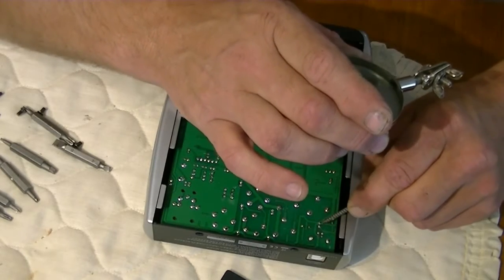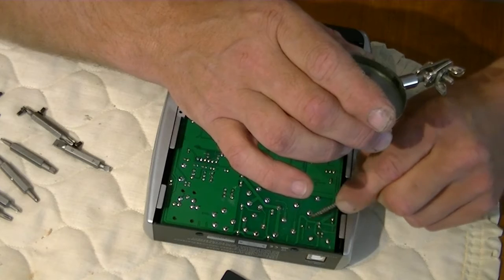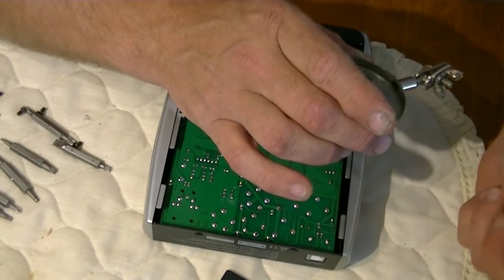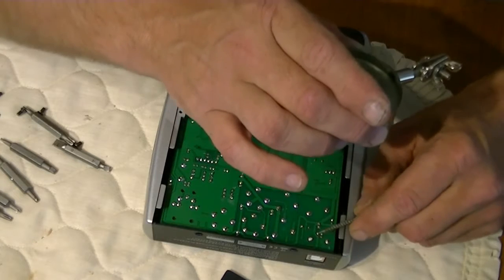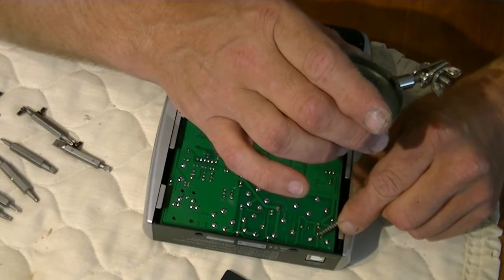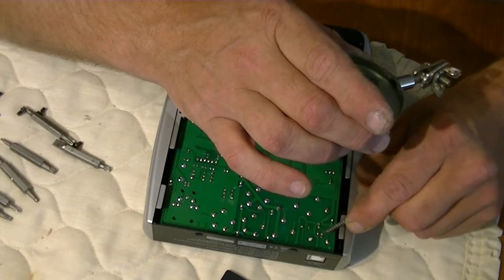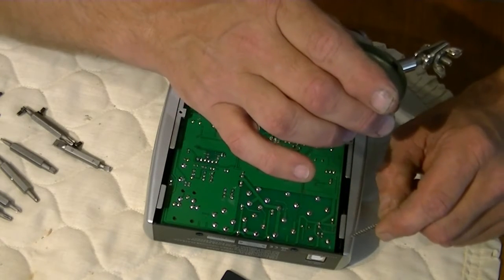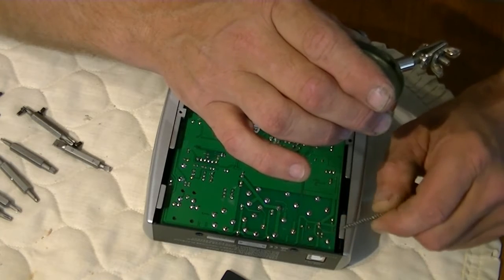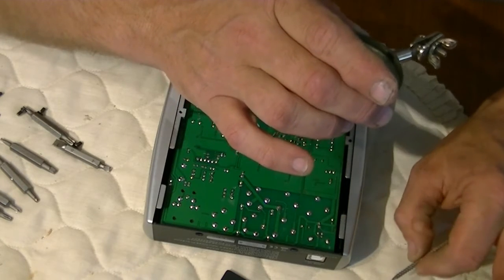And right in here, 1, 2, 3 brown solder joints. They're brown. Like, hello, people. That one's very marginal. That's brown, that's brown, that's brown. But that's marginal. And that's the main connections for the USB, but at least they're solid enough that they're going to make connection.